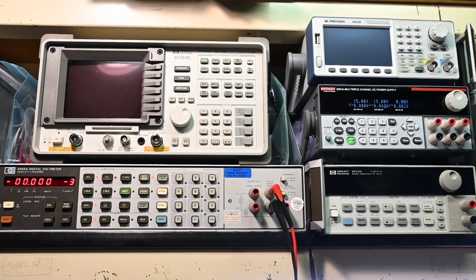Okay, so to create the dual rail supply, you just need to put a jumper between one of the negative terminals and one of the positive terminals. So you could go this way or it could go this way. All right, before I do that, I'll just show you the output voltages. I'll grab my test leads right here. The numbers are jumping around right now just because the leads were floating. They were touching together like so, and it sits at 0.